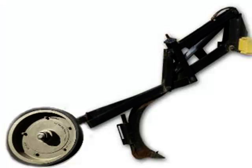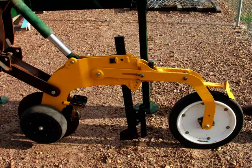There's also other things around. You probably haven't seen anything like this before. This is built by Simplicity, and it's called a Striker. There's a few of them on the downs. It's a walking beam style rather than a full parallelogram, but it's not very big, so there's not that much chance for unevenness to stuff you up. It's very light, which might not suit you too much, but the breakouts there, it's got plenty of strength.